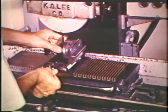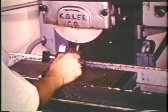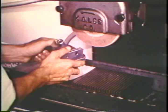Now the actual wheel dressing begins. Start by mounting and lining up the angle dresser on the magnetic chuck. Set the desired angle on the dresser. Move the table until the center line of the grinding wheel is even with the point of the diamond. Follow the procedure for dressing an angle covered in module number 5.3.F, grinding an angle. When the angle has been formed, remove the angle dresser and clean up the chuck.